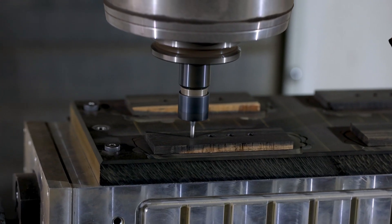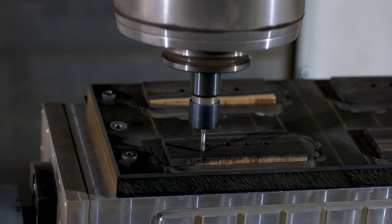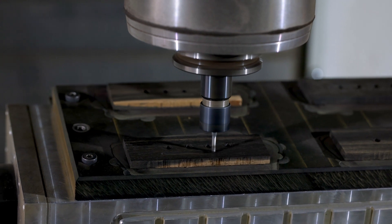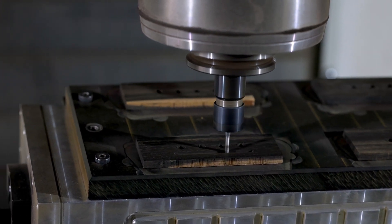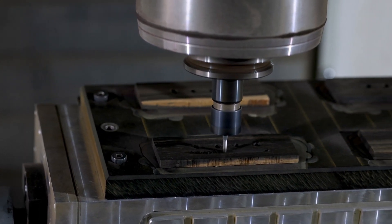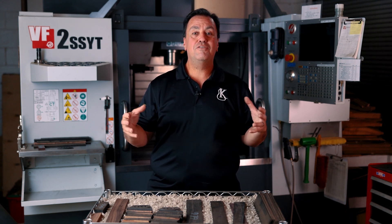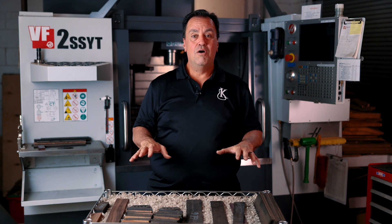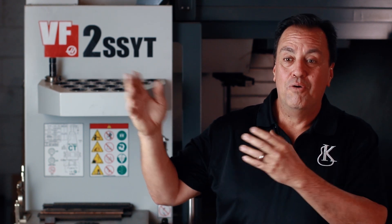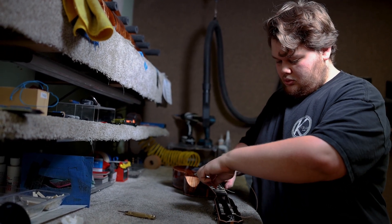With the bridges, we actually put our 10-degree backslope into our bridge slot by rotating the table and gaining access to the workpiece, cutting out that channel with precision — which in turn allows for playability, intonation and tone. All of these different subtleties are being addressed while we're creating these workpieces, which ultimately that precision is going to help when we get into final assembly, where we put the strings on and really hear the voice of the instrument for the first time.